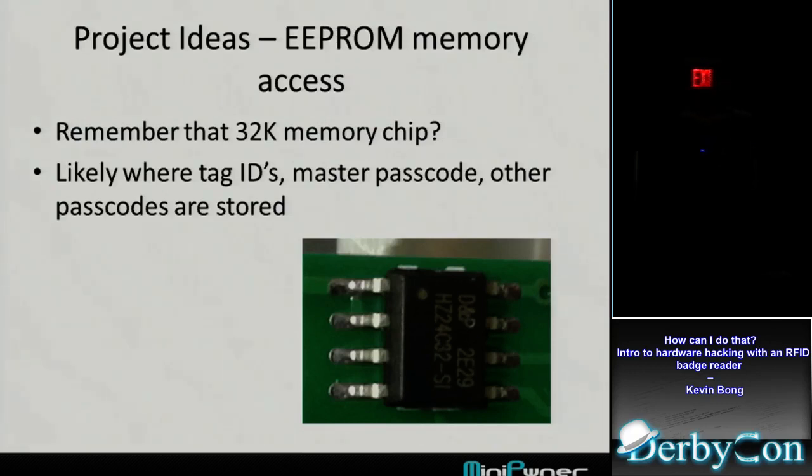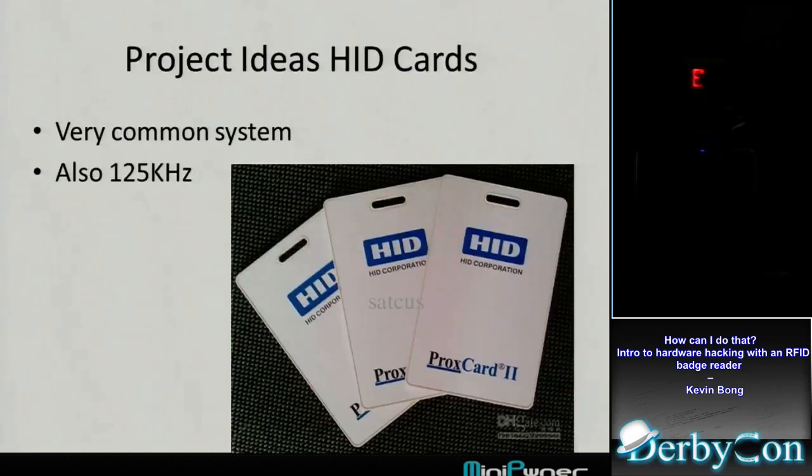It came as a version 3.0 board, and they kind of figured that out, so they added this little push button here that the back of the panel pushes down. And while that's down, it works fine. If that button's out, it's got an alarm, beep, beep, beep, like someone's opened the panel, which I just bypassed by soldering the points of the thing together. But you open it up, and it was just a screw to open it, and from there I could open the lock by bridging these pins across the relay, or a bunch of things you can do. So it's not a secure lock, and you get what you get for 12 bucks, but it's fun to play with. So that's one project idea I haven't tried yet.